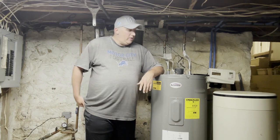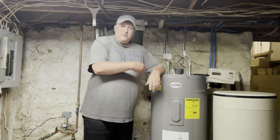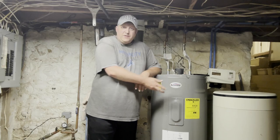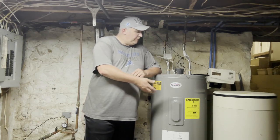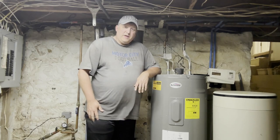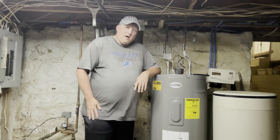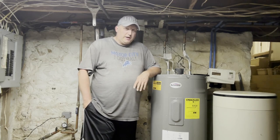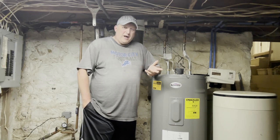I know this isn't a great review, but if you're going to take your anode rod out to get rid of sulfur smell, just know that minerals from your well water can rot the inside of these water heaters. Some people say they've gotten 10, 15, 20 years out of it; others took the anode rod out and only got two or three years before needing a new heater. I'm going to stick with this — if it lasts five to ten years, I could probably say the Corro-Protec anode rod was the right call.